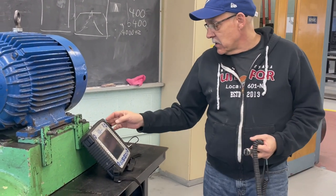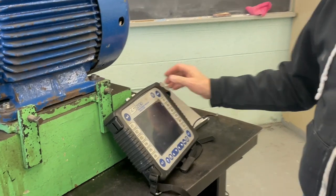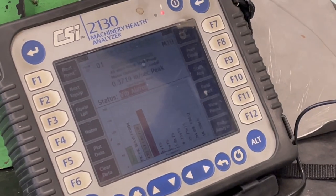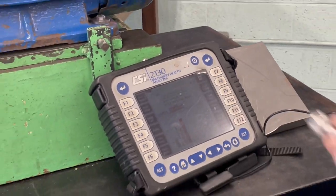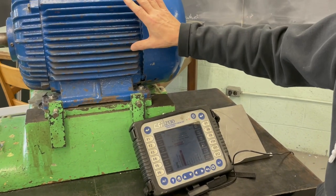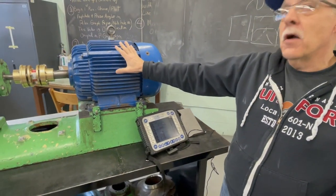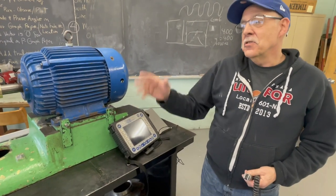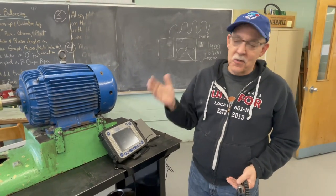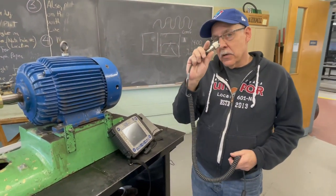I bring up my box and program the route. Here we have route data loaded — position O1 M1H, motor horizontal, position one. When you're doing this, make sure you're in the right position. Equipment may be spared or not running — if you skip it without advancing the box, you reach the end of the route with machines left over and you don't know which ones you missed. You'd have to go back to the start and do the whole route again. Always check you're in the right location.